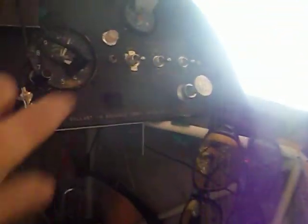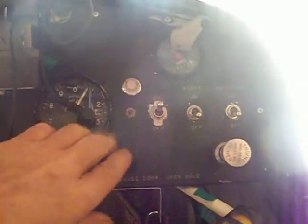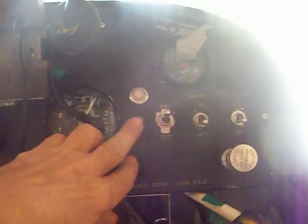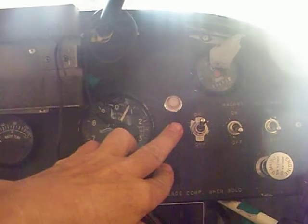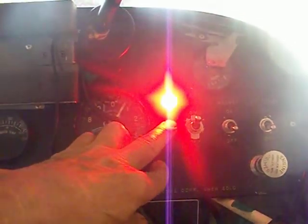But in this header tank there's a sensor, and that sensor has a float, and when the Sidewinders drain completely and they start to draw down the header tank, the float at the top of the tank will send a signal to this light right here in the dash. It's a very bright LED. If we turn the master on, we have a test switch here, always confirm that that light is in operation. We check it as we're running off the Sidewinder tanks, aux tanks, to make sure that that light is not failing.